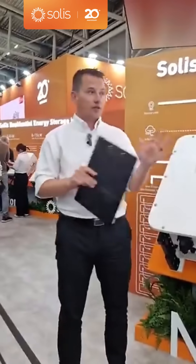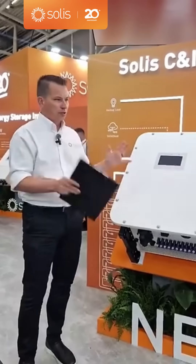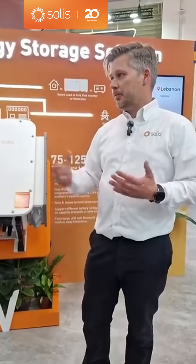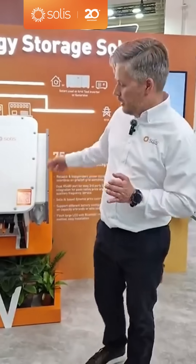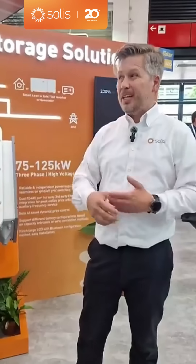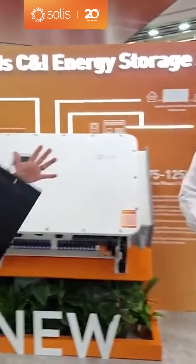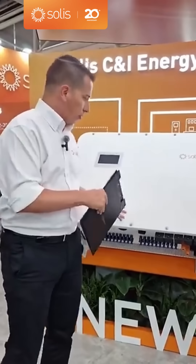I've installed many 50K hybrids. Depending on how the PV array is installed — say it's a rooftop installation — you don't want to pull DC all the way down to the ground. You put this on the wall on the roof, and you may have a battery solution on the backside of the wall in rack systems. Or you could put it on the side of a big battery, say 250 kWh from any brand, take DC from the battery straight into this, and have AC through that system as well. That means a smaller footprint and easier installation. You can pre-install it at your warehouse, then when you come out on site, you just drop it in and you're done. It's a flexible solution — you can do almost anything with this inverter in multiple situations.